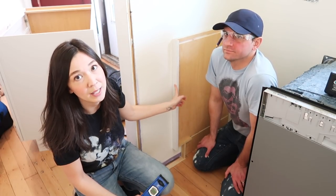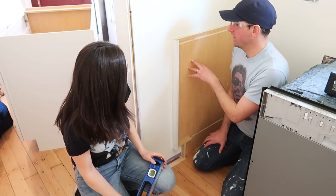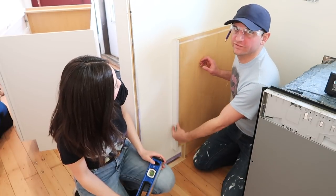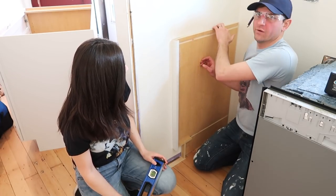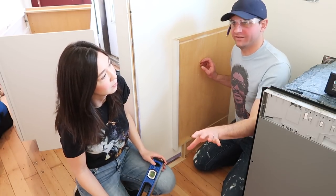All of these are going to make the cabinets look seamless. So this side panel was provided from our designer. Number one, it's got the finished piece on the front. It's going to allow the dishwasher to butt up against this and look really clean and nice. But also, this panel will actually support the countertop because the dishwasher supports no load — it just slides in under the counter.